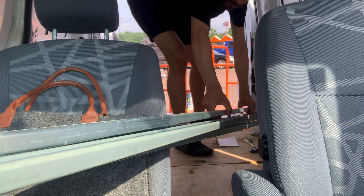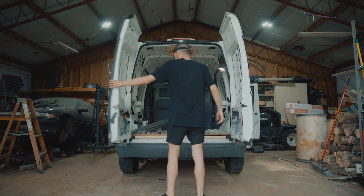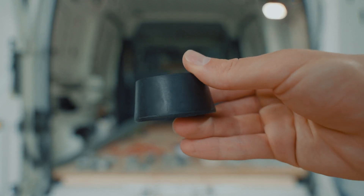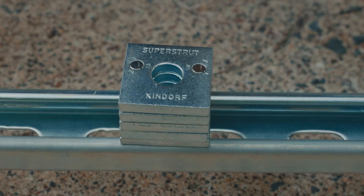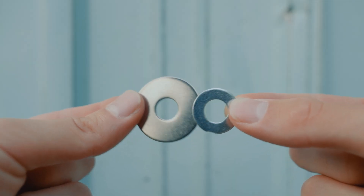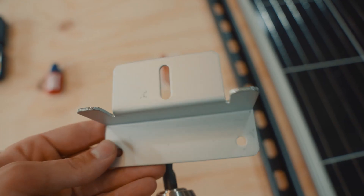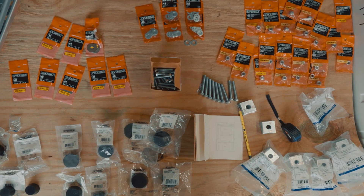So let's go through some of the parts I needed for this project. I went to Home Depot and bought all this crazy hardware, which includes three of these 10-foot 14-gauge unistrut channels, a few different sizes of rubber stoppers, a bunch of magnetic square washers that fit perfectly on the unistrut, like 20 of these 3/8 bolts, 20 nylon locking nuts, a whole lot of 3/8 washers, some truck bed coating to paint the unistrut, and 8 z brackets to mount the solar panels. All this hardware is really what makes this project kind of a headache.